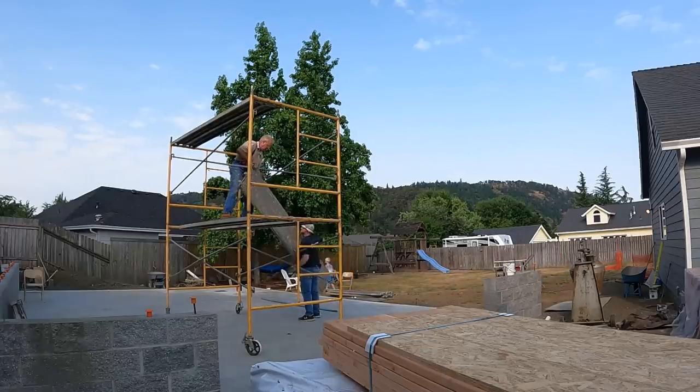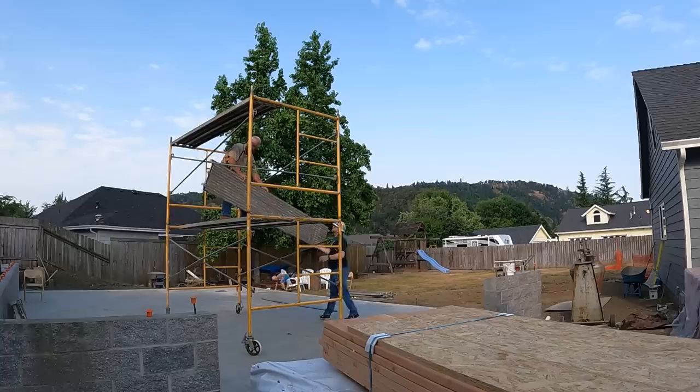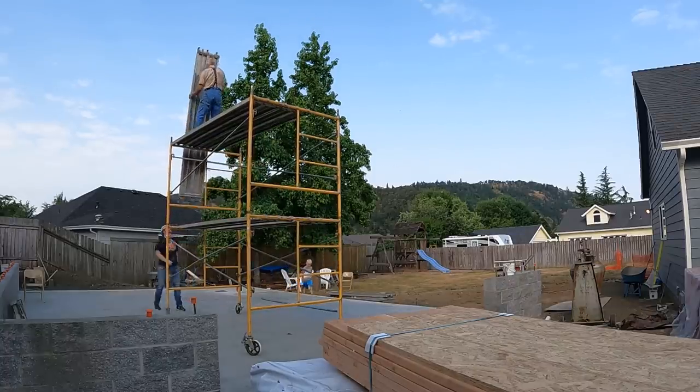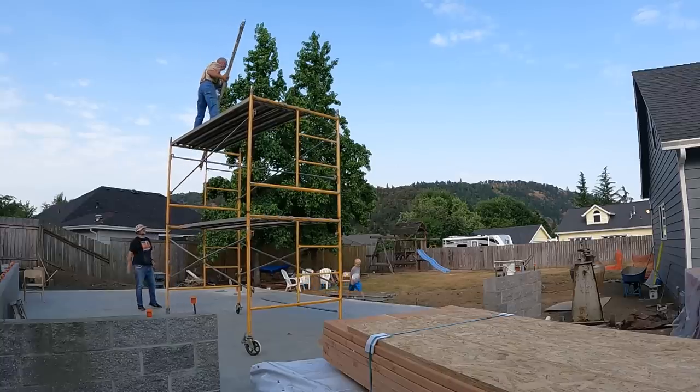Well, I think I'm mobilized. I've got the lumber staged in here just about right. It's gonna come in the right order. I've got it put in so I don't have to move a bunch of stuff twice, and that's important. I've got the tools on the job. Some of them need a little work after the spec house project. They got a little bit of the life beaten out of them, but I think they're gonna serve at least one more time. So now that we're ready, I'm going to go get the hold downs that I need, some new washers for the anchor bolts, and start getting some lumber in the air.